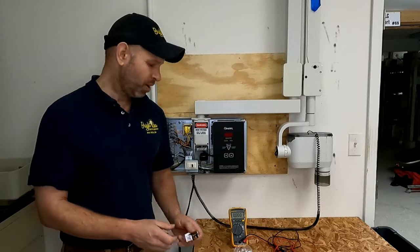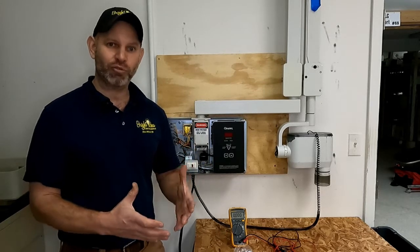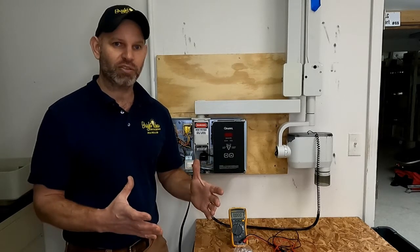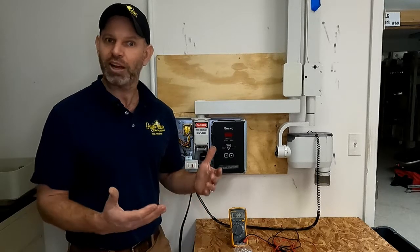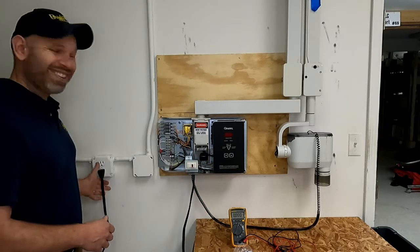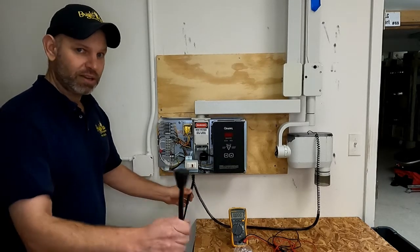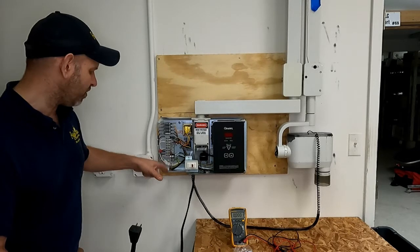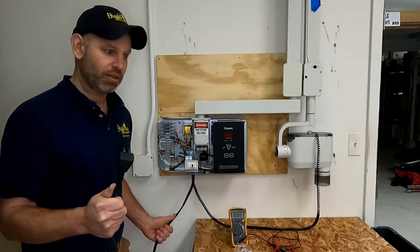To be safe, we need to make sure we don't have power applied to the unit. With this being the primary power switch for the x-ray, it always has power to one side of it. So if you start messing around with this switch without turning the power off, you're in for a nasty surprise. To make sure you don't shock yourself, disconnect the power cord from the wall and verify that the cord is hooked up to the two poles marked 115 volts and zero. If you're holding it in your hand and it's not plugged into the wall, you know there's no power applied.